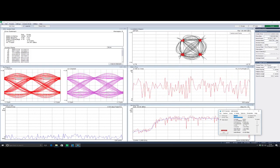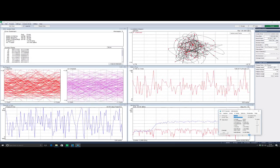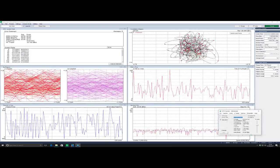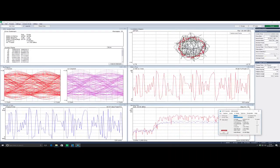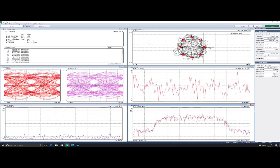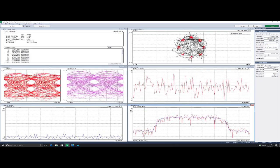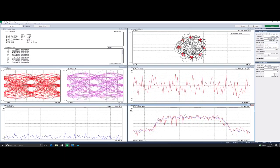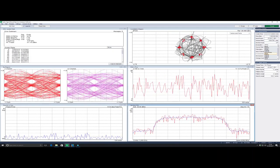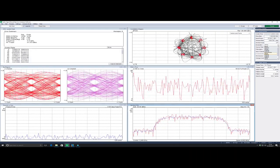We can also go to QPSK. Obviously have to change over to DVB-S2 and change that to 8PSK. That's about the only two modes that the signal analysis software supports at the moment. Hopefully they'll add more in the future. I mean, it does do other things like QAM and what have you, but not the special APSK that the DVB-S2 uses.